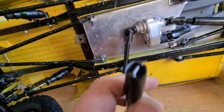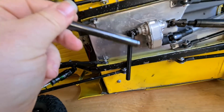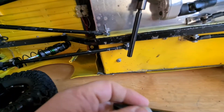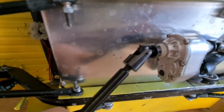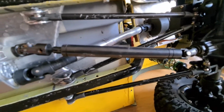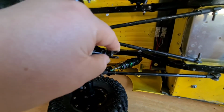Oh, hang on, I can show you what happened. This linchpin came out. Now these, I don't know if anybody knows about metallurgy, but they're not Chinesium. They are really, really good quality steel, but the linchpins are not glued in. They're not even remotely. Although, having said that, there's no sign of movement on the front drive shaft, and they are identical. Yeah, and they don't really fit. If you see the movement there, yeah, they don't really fit on these axles very well.